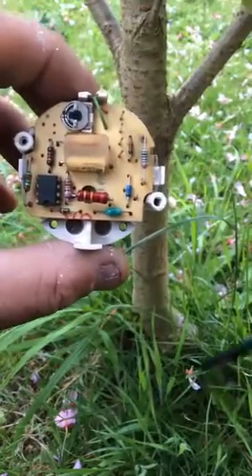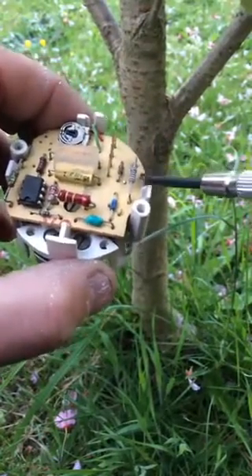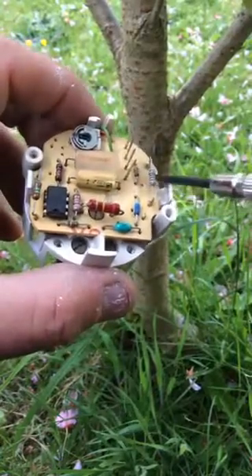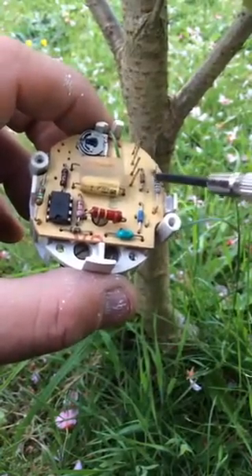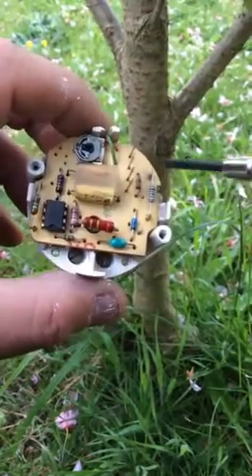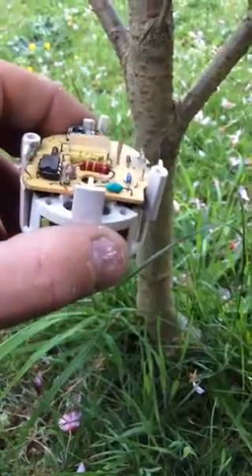And that's it really. The only other thing I found while doing it — be careful — I noticed that after I'd been brutalising the whole unit, this component here had developed a couple of dry joints and was just wiggling around in there, so I just had to re-solder these in. Something worth doing if you ever do this: just check everything over before you reassemble it.